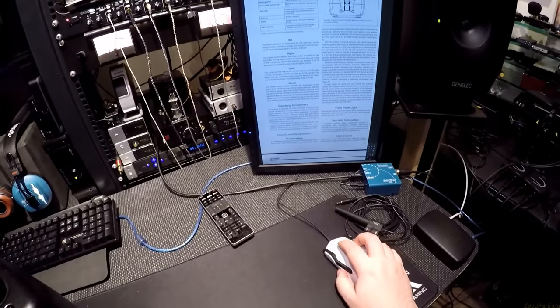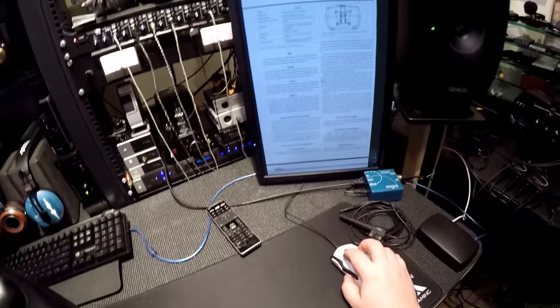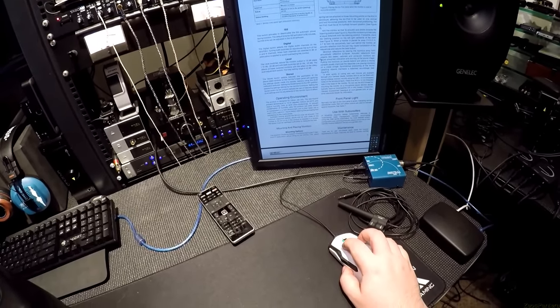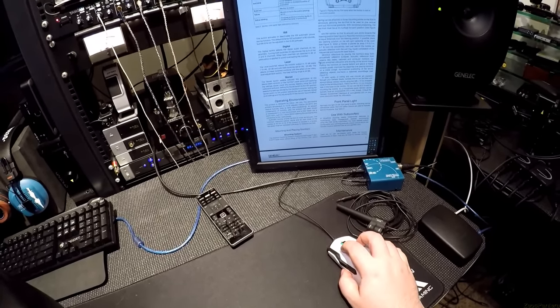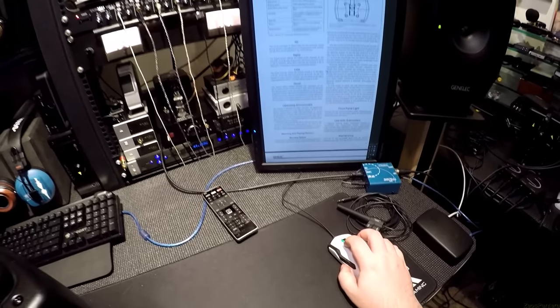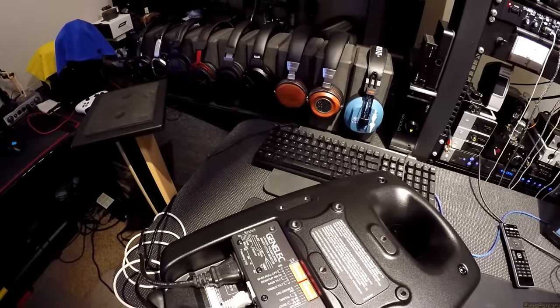What does stored mean? The stored switch selects between the application of the controls listed above on the monitor back panel and applying the settings stored in the monitor using the GLM calibration software. Setting the stored switch to off selects the monitor's controls. When the switch is on, internally stored GLM settings adjust the monitor, and the monitor's back panel adjustments have no effect. Ooh! Okay, that makes a whole hell of a lot more sense.